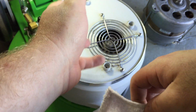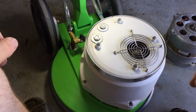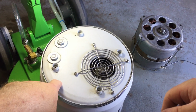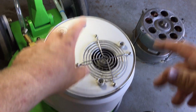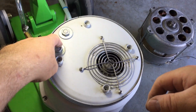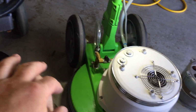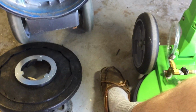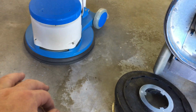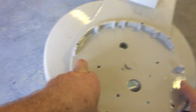And these motors will last decades usually. If you've got a good quality machine, it'll last for a very long time. This particular machine is actually 1.5 horse. This is a Swiss-made machine, European, really high quality machine. It's a dual capacitor, so it just runs fantastic. I think they're about 10.5 amps, so it's not a high amperage draw. And yeah, the quality of the machinery from Europe obviously is often better than what we see nowadays.